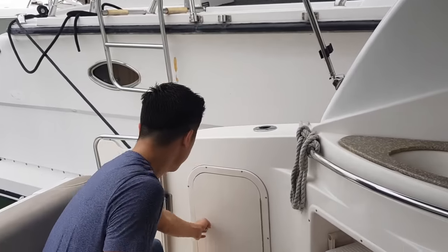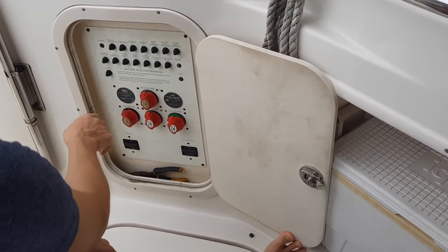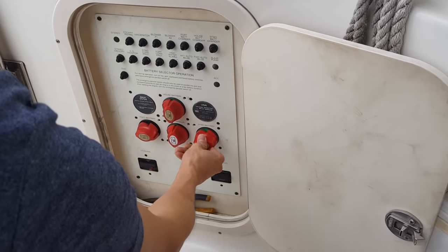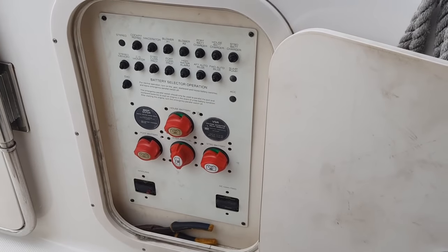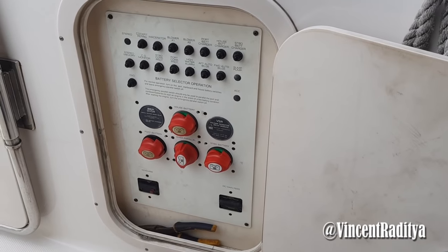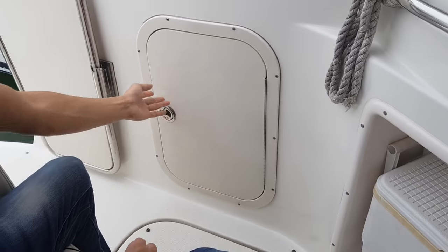Okay, now before we're able to start the engines, we're required to start the electricity. To do this, as you can see, we have the electricity panel. This is the contactor. Turn on the port battery, the starboard battery, and the house battery. And you also have the emergency switch that can bridge these two, in case one battery is low, so we can still start from the other battery. Normally, we turn on the electricity now. Now you can follow me.